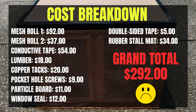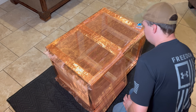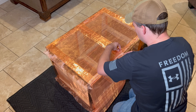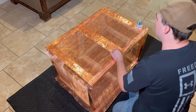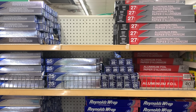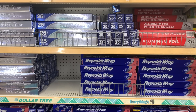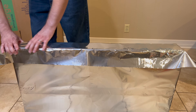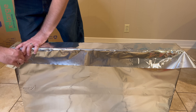That brings us to a grand total that's the closest I've ever come to using profanity on this channel. The first thing I'd change is that I wouldn't use copper — it's just way too expensive and hard to find locally, and if you need to order more than expected, you'll pay a lot again and have to wait. Instead I would just use heavy duty aluminum foil: it's cheaper, easy to find locally, and it still works — you just have to use more of it. When I tested it a couple years ago, I found that three layers of heavy duty aluminum foil would stop cell signals, so I ended up using five for that box.